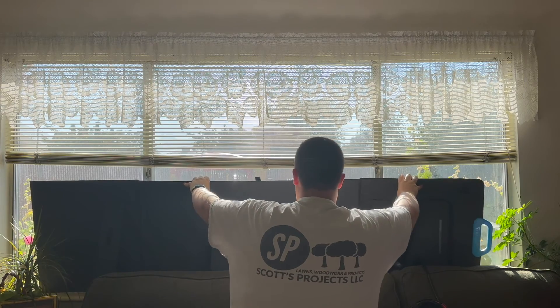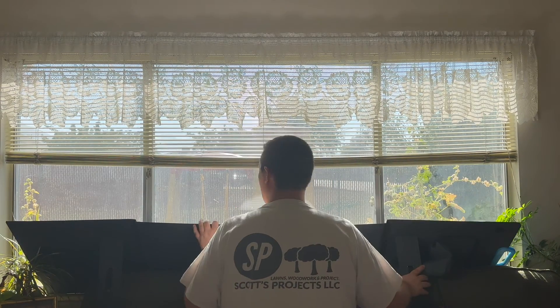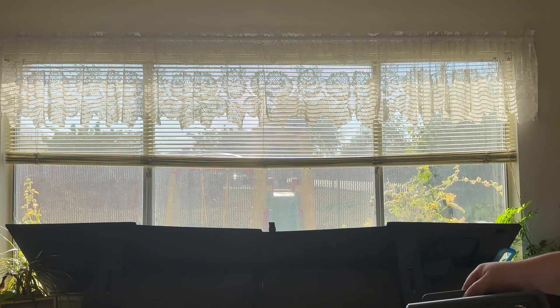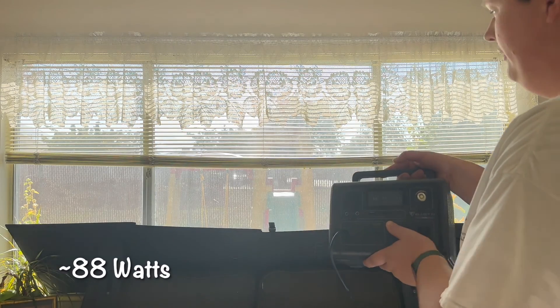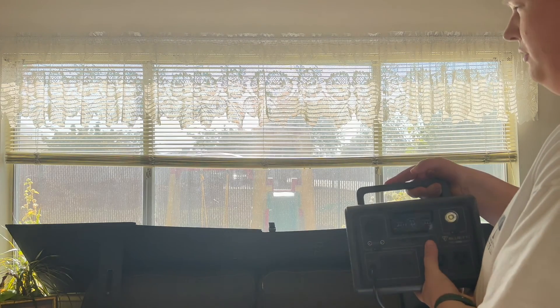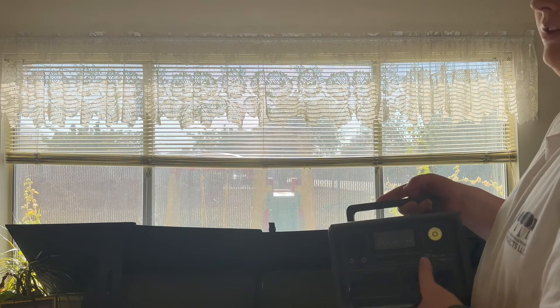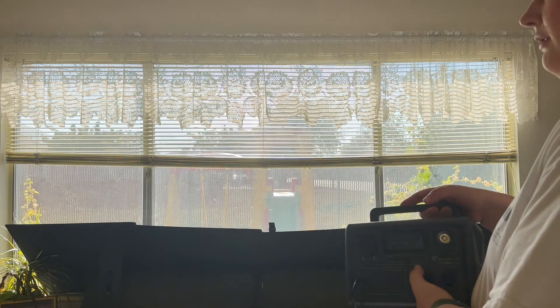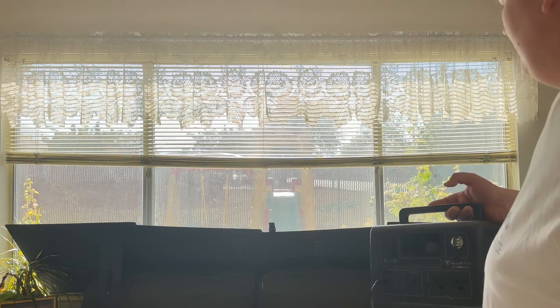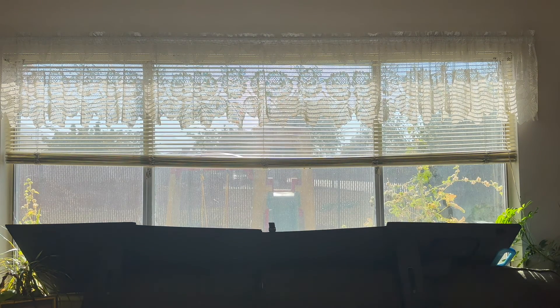Not the easiest task in the world — but okay, that's probably a good angle to test. If we look at the power station, boom, we're up to 87 watts, 88 watts. Just transitioning from the floor directly to the window and getting the blinds out of the way — so 88 watts, that is quite a difference. That's actually not too bad for a 200-watt panel producing 87 watts. It's almost noon, the sun is at a pretty good angle — it is almost November so the sun isn't at the greatest angle, but producing 88 watts is pretty impressive. Now let's take it outside and test it.